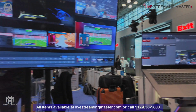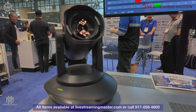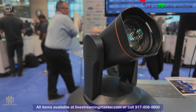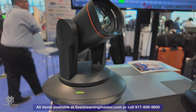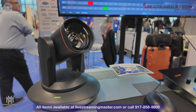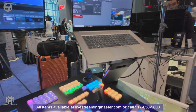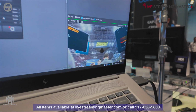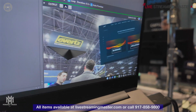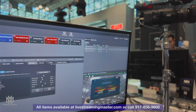We do have our new PTZ 3 UHD Plus, which offers mini XLR to XLR connectivity. There is phantom power that you can enable as needed. It does have automated tracking capabilities built in, in addition to providing tracking information for anything downstream that can leverage that. So it's silhouette framing. You can set bounding boxes and intelligently indicate how close to talent you want to push in and hold to.